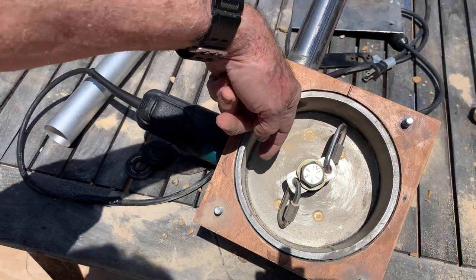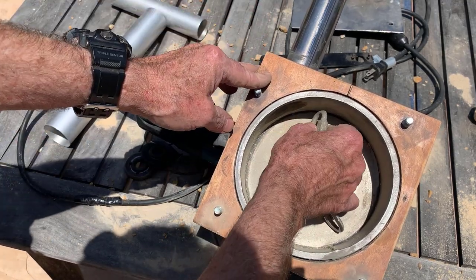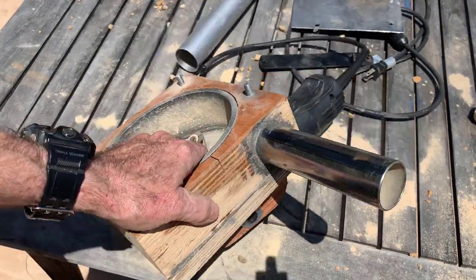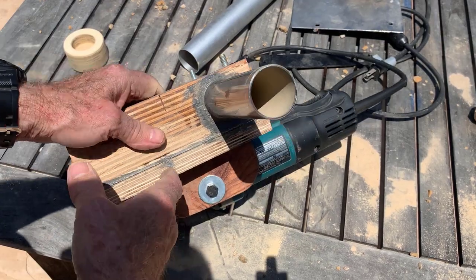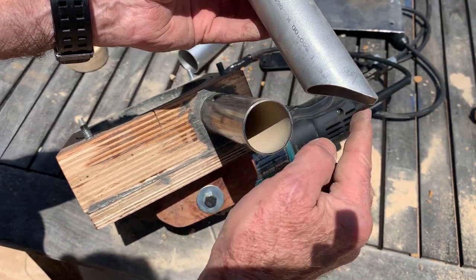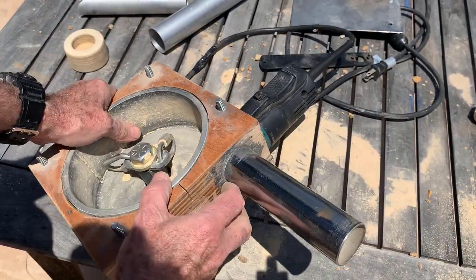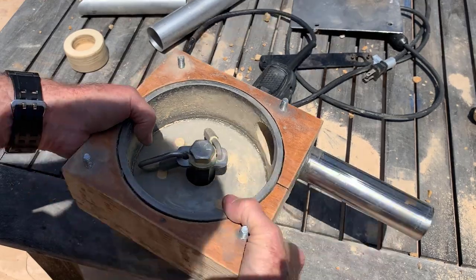The rocks come out here and they get whacked by this thing — whacked downward — which prevents a lot of the rocks from shooting back out, although you do get some. I have a cap that goes over that. This is a steel pipe; this is my aluminum prototype, where I cut that shape into it. Being aluminum it was easy to shape, so I got the shape right, then moved to steel. It's bonded into this assembly using JB Weld epoxy — absolutely tight.